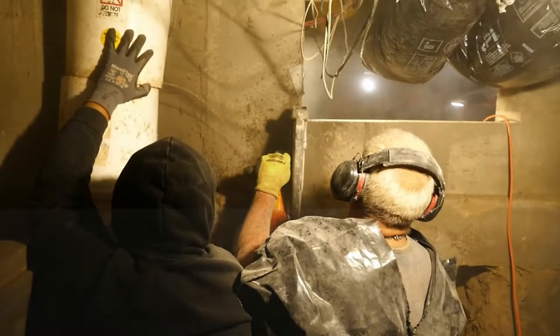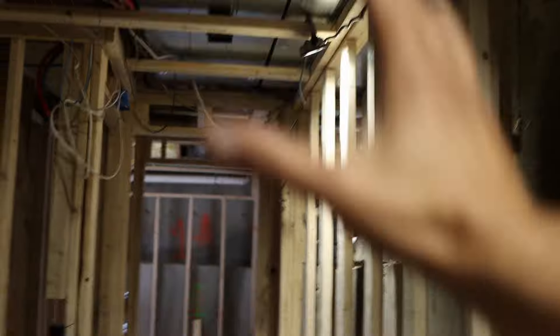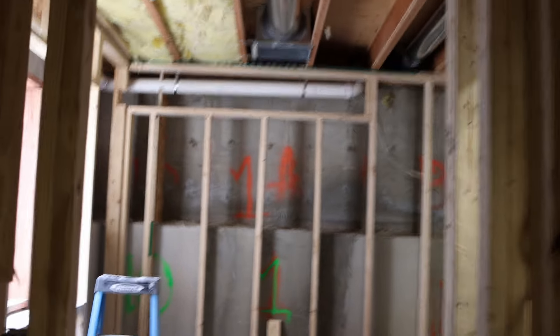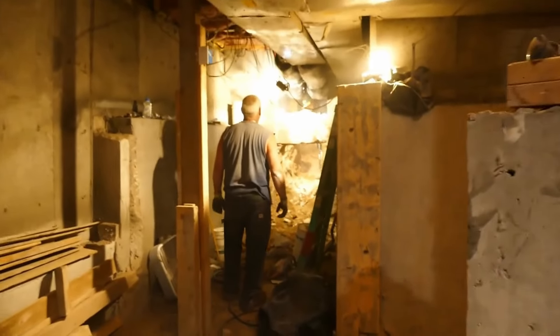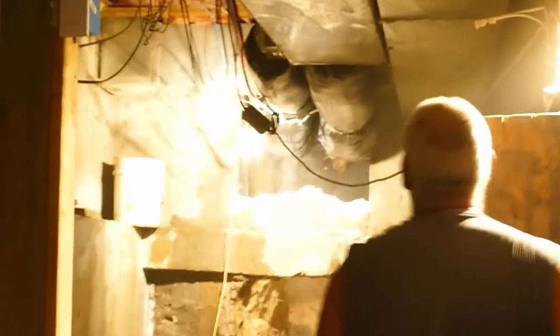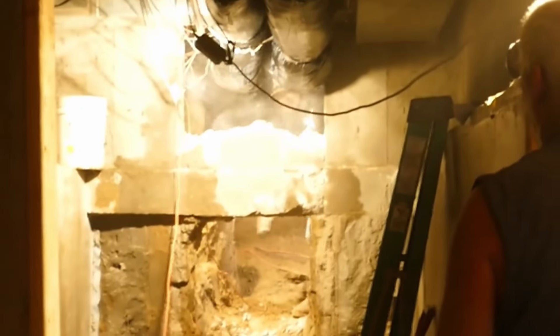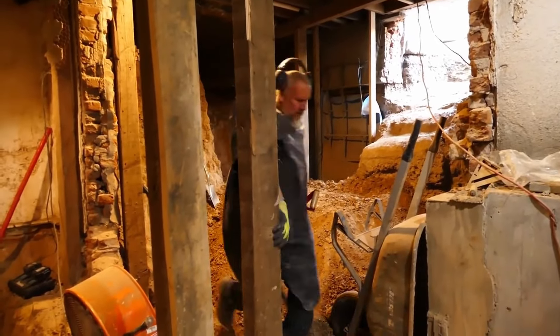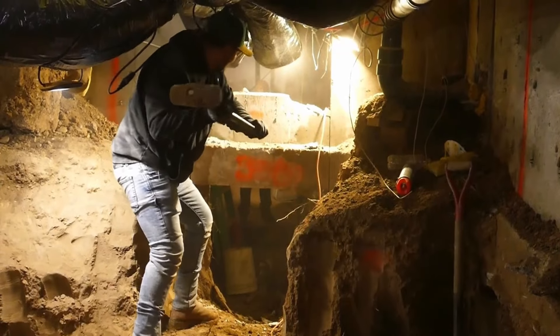The questions we'll address in this vlog are: what is a crawl space to basement conversion? Once we cut through that concrete wall, this was all crawl space in here. We had to dig all this down to what you see right now. Once we had this dug down, we opened up this room. For example, in a 20-by-20-foot enclosed area, there may only be enough space for two men and a wheelbarrow to work efficiently. Those two men may be removing dirt for three weeks before the project can move to the next phase. Obstacles such as a tight squeeze between the home and a neighboring property typically don't allow for full access of heavy equipment — we rely heavily on manpower and old-fashioned techniques.